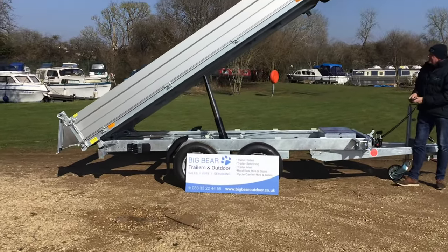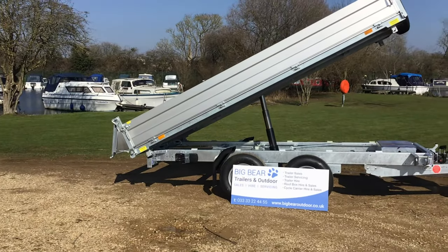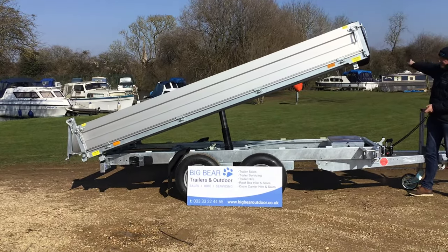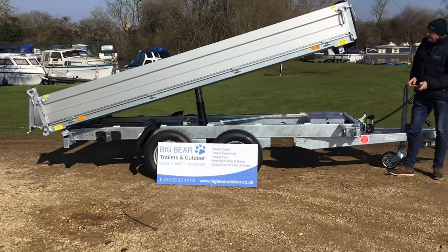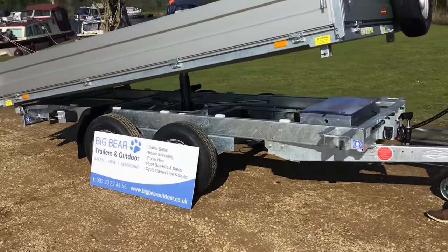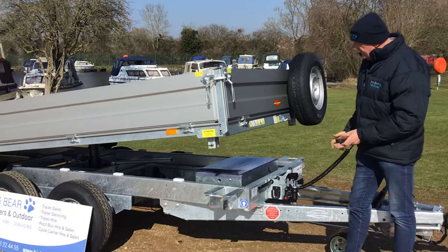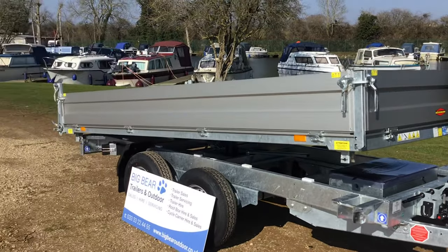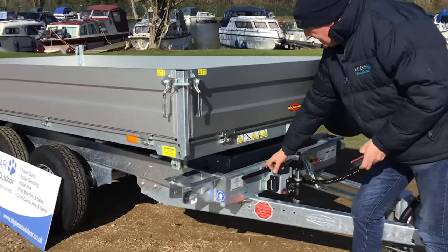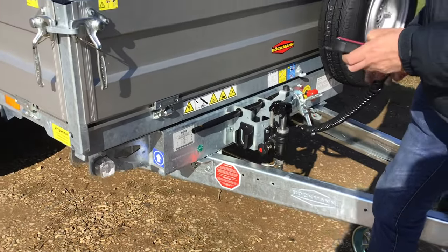Once we're bringing it down, we can then switch to one of the sides. My suggestion is we move to tipping away from us over here. To do that, we just need to bring the bed down. At the moment our pins are set to the rear, so that's the pivoting point for the bed. All we're going to do is move the rear corner pin over to this corner, and then the bed will tip that way — really nice and easy. You've also got a manual pump option, so if for any reason you get caught where the battery is absolutely dead, you've got that manual pump option.